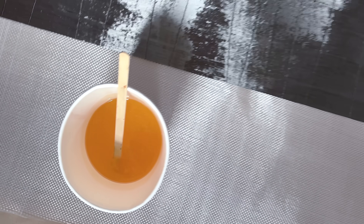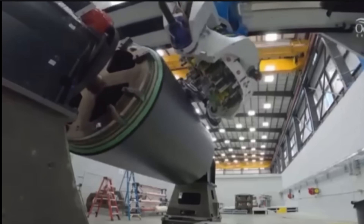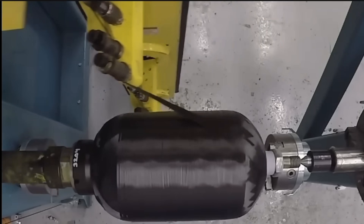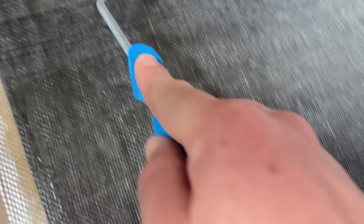In the meantime, you can watch me take over my living room floor for a prototype wheel rim lamination. Spare glass fiber outer and inner skins because it's cheap and wets out easily, then a double layer of unidirectional carbon captured inside — which I promise is not a precursor to making a pressure vessel for a DIY deep-sea submersible, though it's disturbingly similar. Lots of thin rolling to pop out air, compress the layers, and wet out the carbon — unidirectional is notoriously slow to wet out, like a barrier.